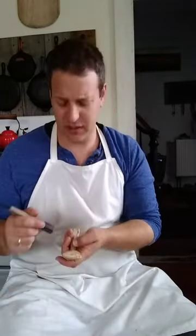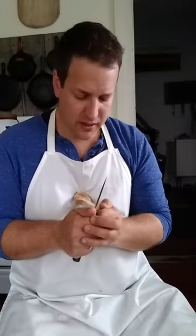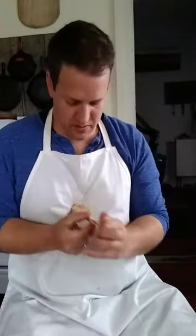Now I'm going to do the sides of the handle first, which is different than how I normally do it at the beginning, because if I'm going to hit those back shoulders, I want to do it now before I cut them again and get a nice clean line on them. Notice how I moved this down. This was too high up, and it kind of could wiggle, and that's a real danger. If this wiggled and slipped, well, then all of a sudden I've got a knife sort of jamming up towards my face.